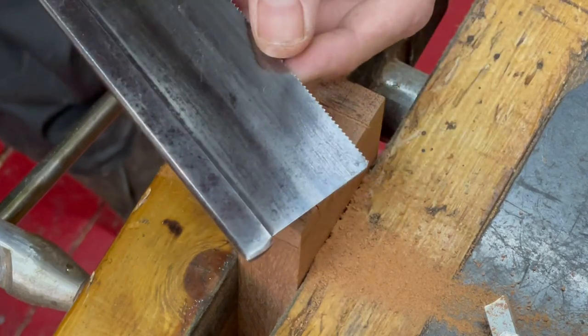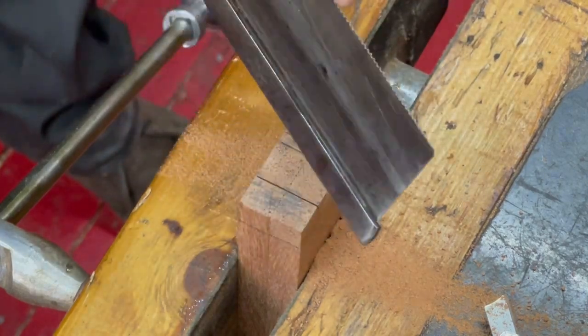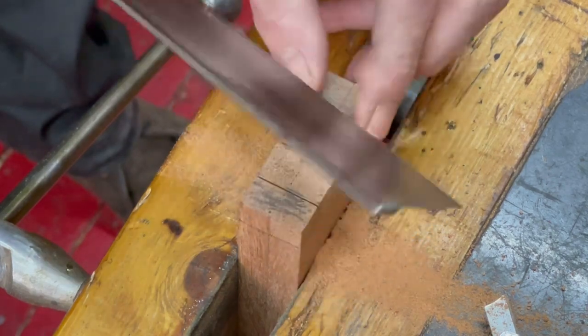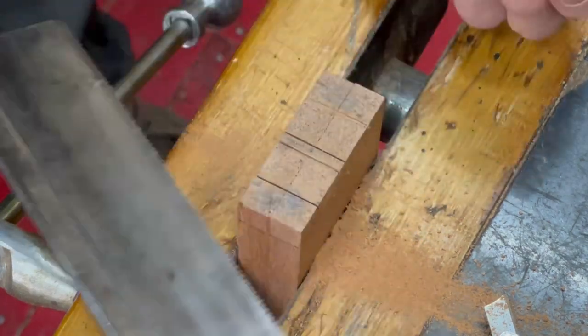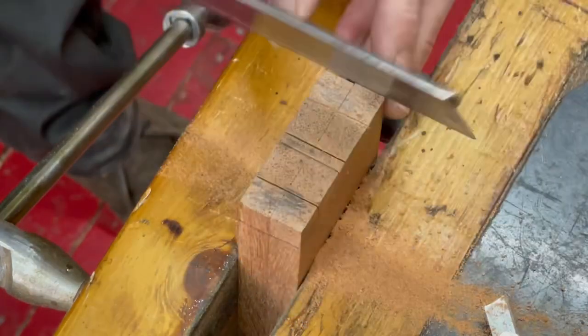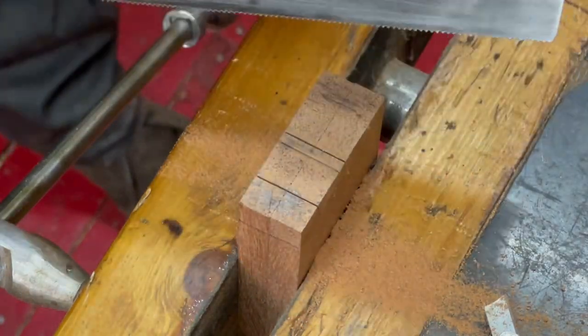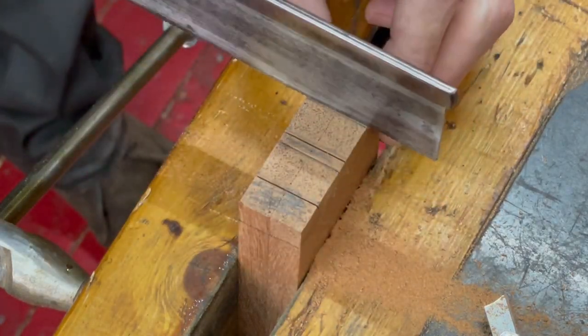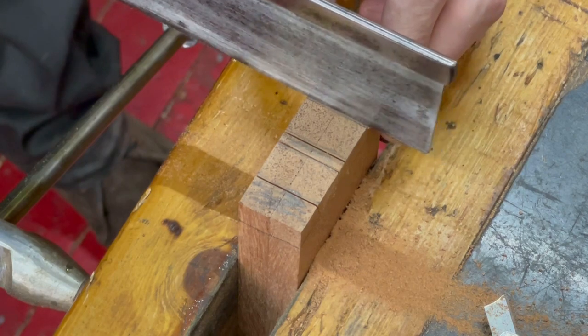Make sure your fingers aren't touching the saw, especially one where the teeth are set on each side, because when you put your fingers there, you'll cut your fingers. That's why I always like this one, so there's no set to the teeth. But if you're cutting something deep, then it could sort of get caught up in that wee bit. So the line, which I'm half a wee bit off here,